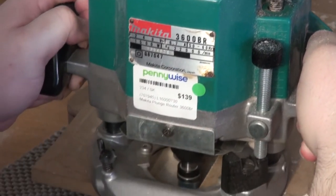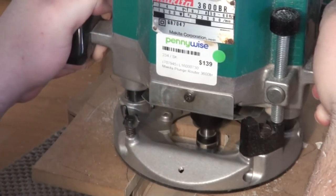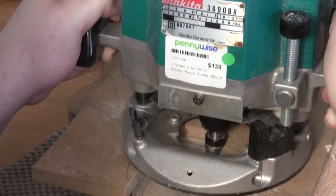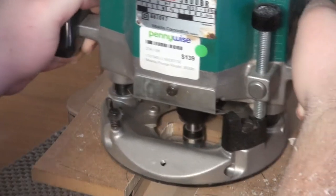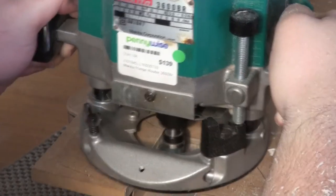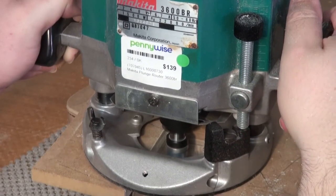This looks like the last pass, where the bearing is low enough, and you will see me running the bearing along the template to guide it. I was running the bit around the template a few extra times, making sure the cut was flush with the template and that I had not missed removing any material in the neck pocket.